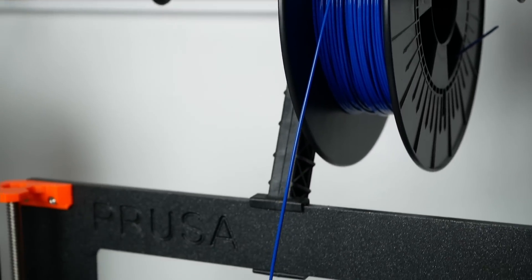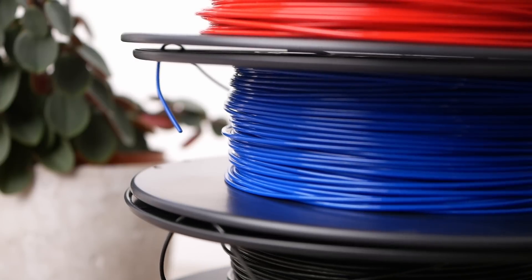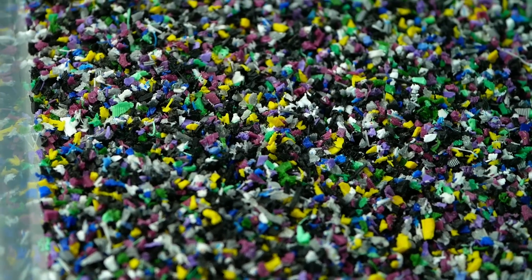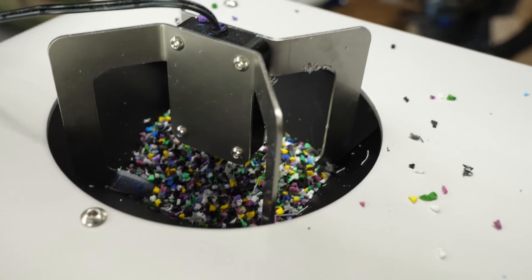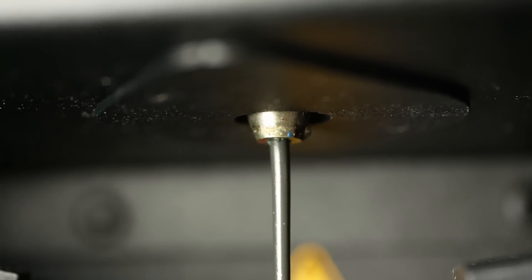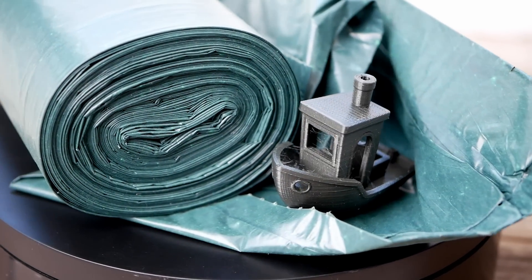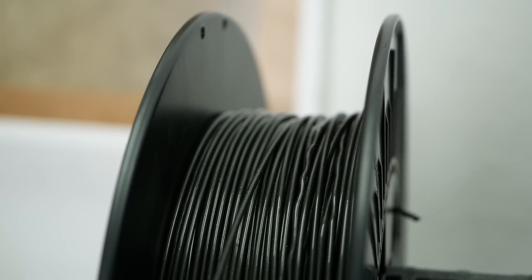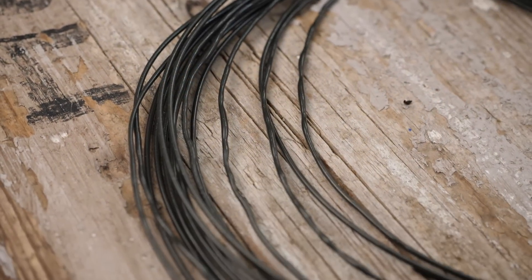After another 2 hours we are greeted with another roll of PLA filament made from 100% recycled 3D prints. Due to the mixing screw of the extruder, the color turned out really nice and even, and we don't see any gradients as we print with it. For the mixed leftover regrinds of various colors and grades, the mixed-up color turned out quite a bit darker than I expected but still gorgeous with a nice sparkle — a dark trash bag khaki 2.0. This material interestingly had the highest throughput at 158g per hour. Unfortunately, looking at the spool and statistics showed that there were even more extrusion inconsistencies that might require removing some pieces during printing.